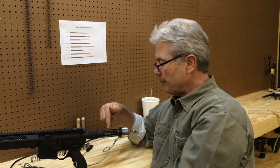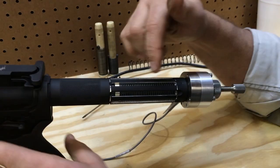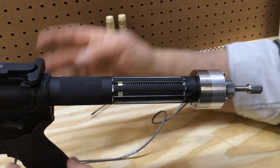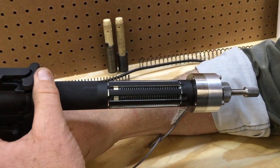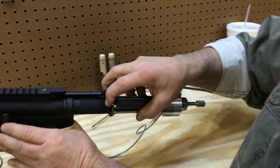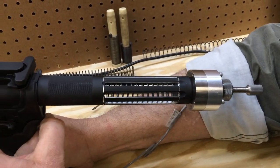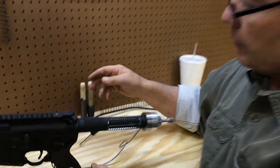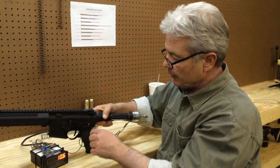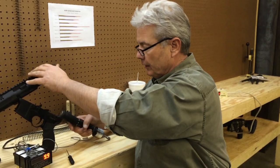Something else to notice — I want to close the bolt a time or two. Watch the spring. It just goes and it really doesn't have any reverberation to it. Now we're going to put a round wire spring in, and I'd like you to watch and see that it's going to oscillate a little bit. You know why we have weights in a buffer? That's because the round wire spring has a vibrational node that runs all the way to the front, to the rear, and back to the front.